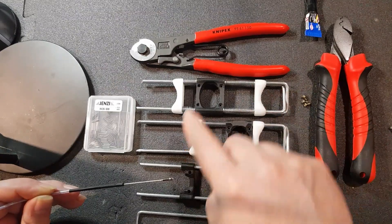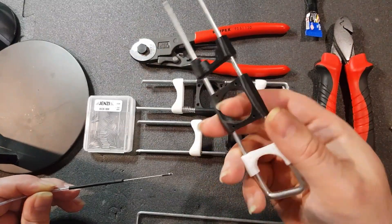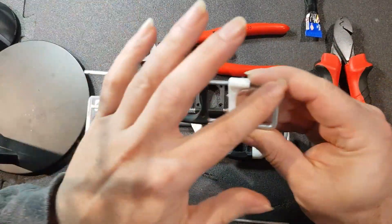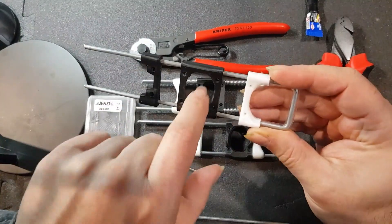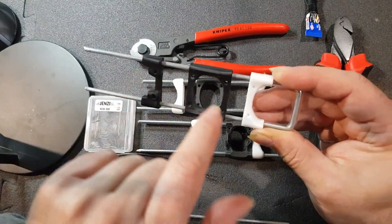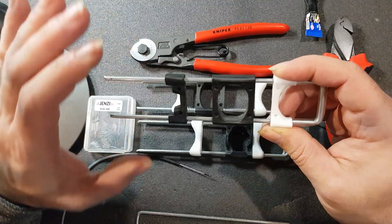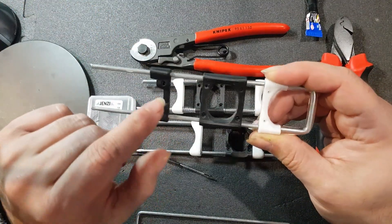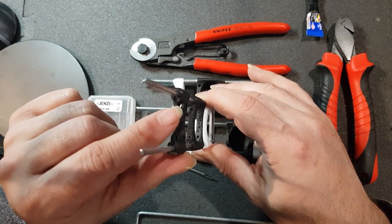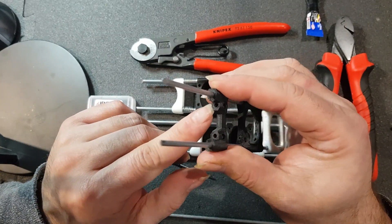These are the latest controllers that I built — I'm just picking one of those, and they're all built more or less the same. You have a metal part that's used to hold a slider, the slider is movable, and that's the part that will pull or push on the Bowden cable. The parts on the sides keep the metal part parallel and also provide something to attach the end of the outer part of the Bowden cable.